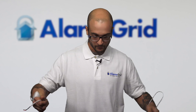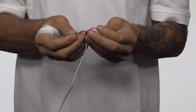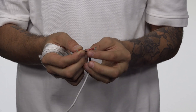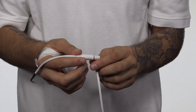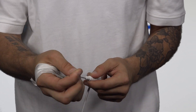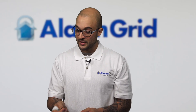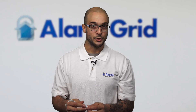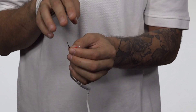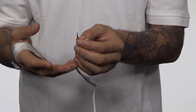We have one right here, so let's take a look at it. The LT cable, as you can see, is a finished terminated power cable. On one end we have finished spade leads that slip right underneath the transformer screw terminals, and on the other end there's a barrel connector that fits into an attachment that has soldered tips. For example, on the Lyric system, it doesn't have a barrel connection, so you're actually going to have to use this adapter and then screw these little soldered tips underneath the screw terminals on the system to get it to power up.